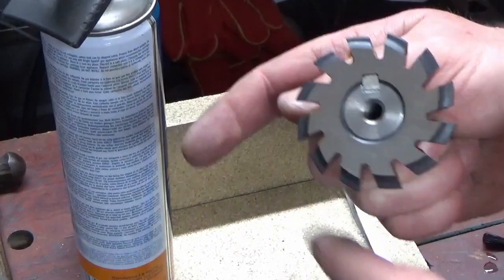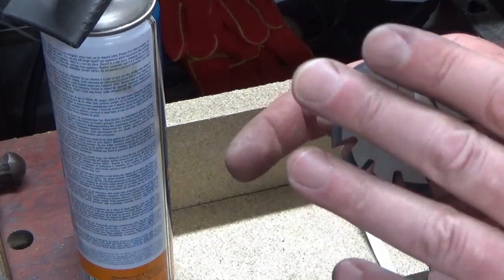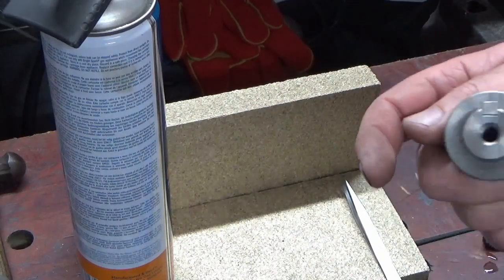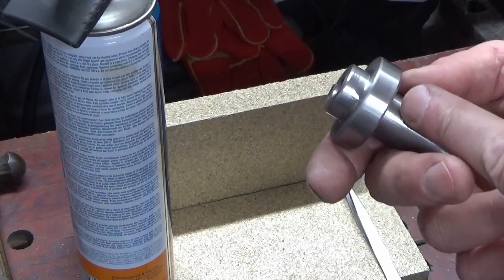There we go. And we've just got some clearance off the face and off the key from the gear for the top cap to sit in position. So the next job now is to give this a thorough degrease, and we're going to pop it in some chemical black, and I'll bring you back when we've done that.